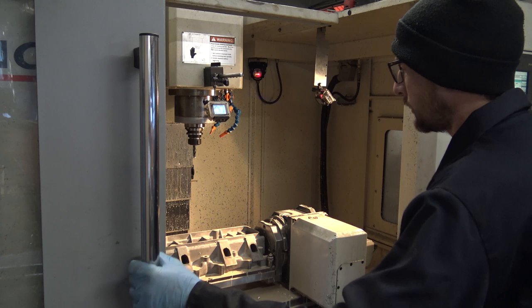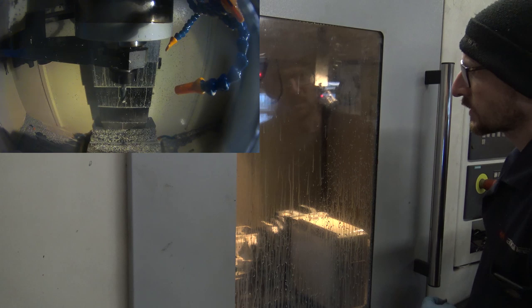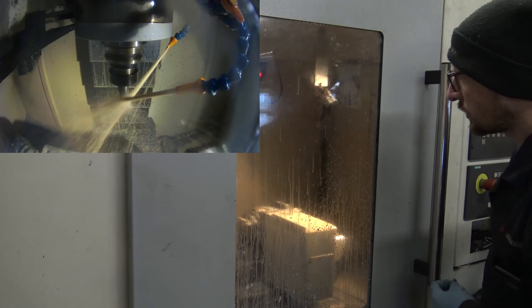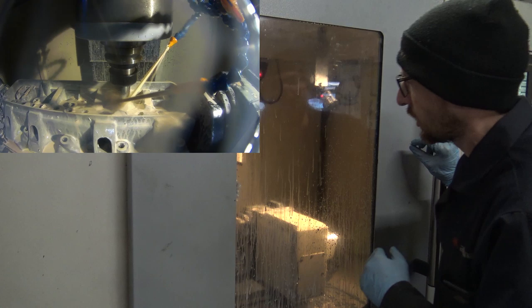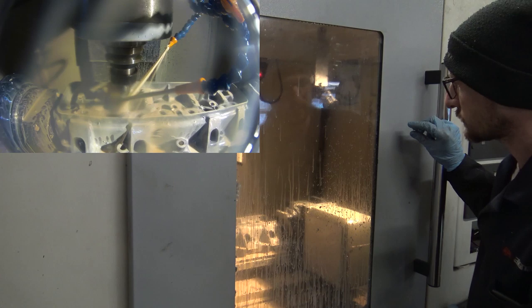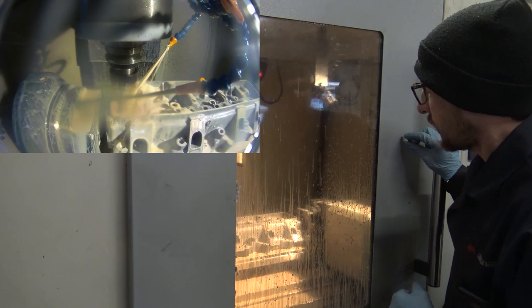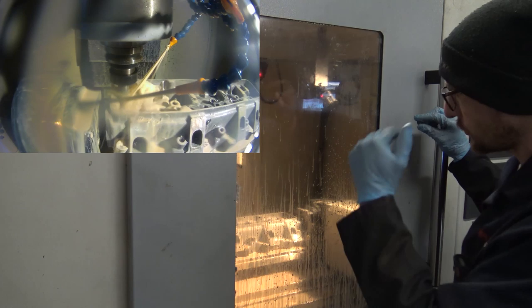A quick tool change. The first thing it's going to do is come down and machine the tops of the casting where the cylinder head bolts are going to pass through - so we're just squaring them off, ready for the washers to mate to. There's the inner three first, because they're at a different height. The outer two on the inner row that are under the rocker cover start higher up, because there is a little bit of side machining to do as you go down to where the bolt head is actually going to be situated.